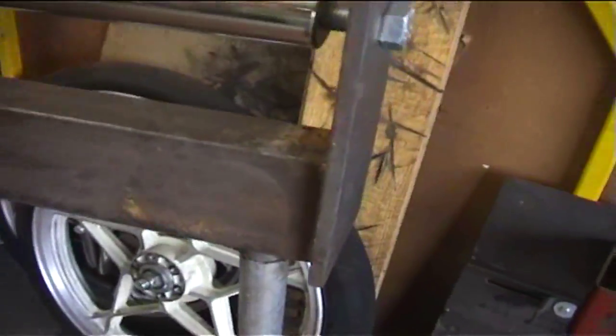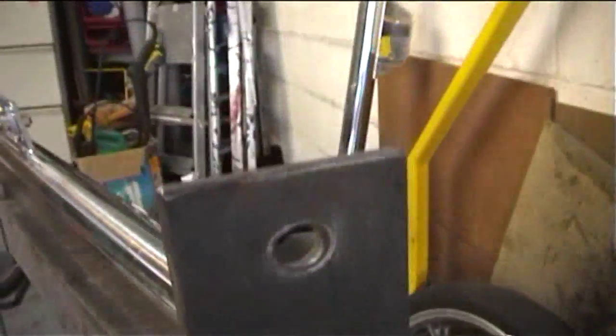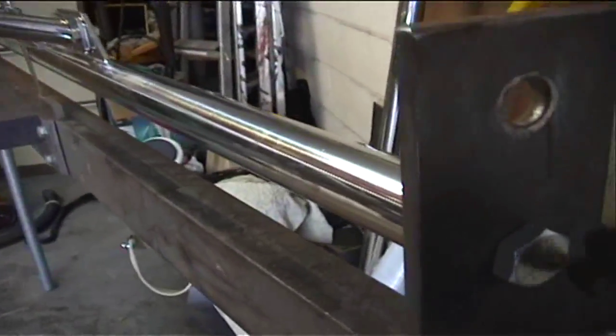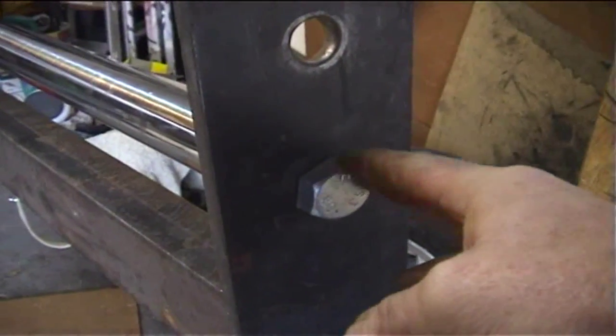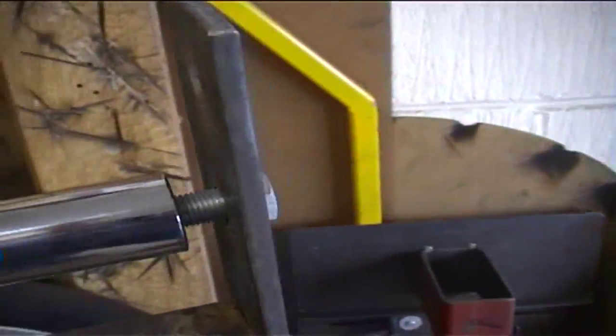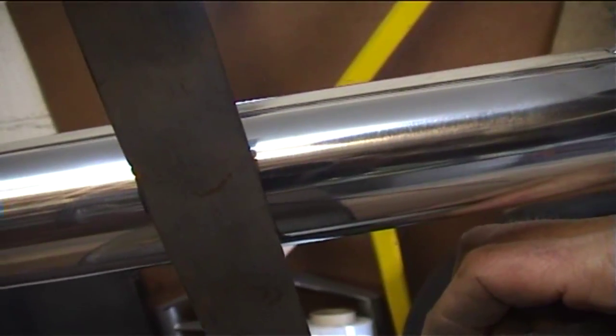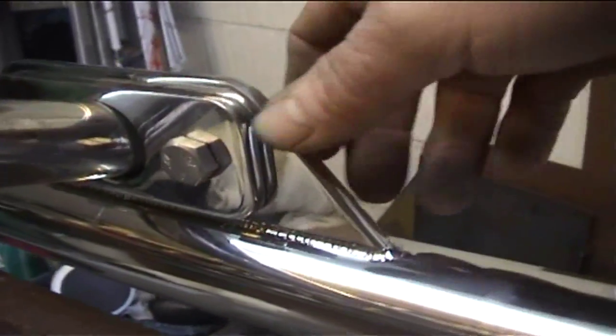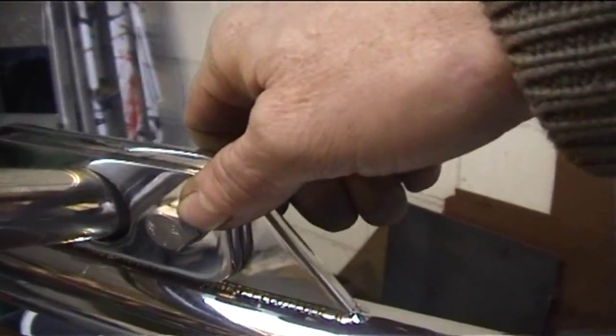On the ends we've got a plate with two holes in it. One is for the Bigfoot wheels, for when I'm setting up a buggy for the Bigfoot wheels. And this one, as we're making a barrow buggy, is set up for the barrow wheels. So we put the axle in there, bolt it on, square it up using a square off the centre line against a mark on the axle itself. Then we bolt the plates onto the axle and align all the side rails up.